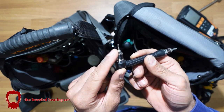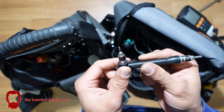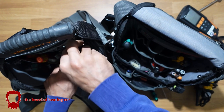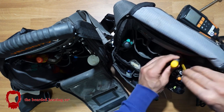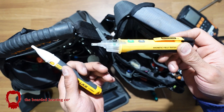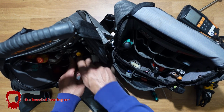And because the other Dutch boiler is the Remeha, the Remeha Avanta has a 2 mil hex allen key for the minimum burner pressure or low combustion setting adjustment — so that's why these are dedicated like this in my bag. That sits in there. Then we have — everybody needs to have a Fluke or some sort of non-contact voltage detector. And this one is a magnetic field detector for pumps, just to prove that the pump is spinning. I don't use it much but it does come in useful to see if the pump is actually spinning or not. They sit in there like so.